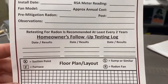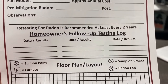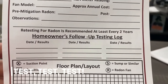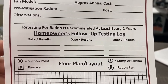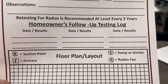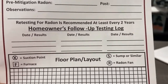The best part is it has a follow-up testing log, which is something a ton of homeowners forget. The EPA recommends testing every two years, no matter what. It's the easiest way to maintain your radon system — if you're not testing, you don't know if it really works. Continuous radon monitors are not a replacement for this, because they don't last forever. Do a lab test every two years, preferably in the winter. If you're safe in January, you're safe in August, but not vice versa.